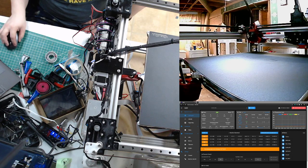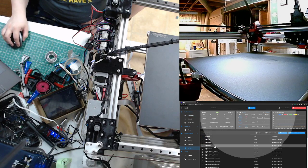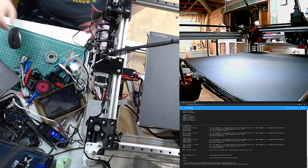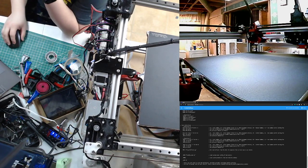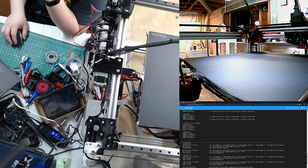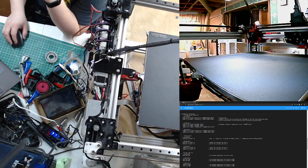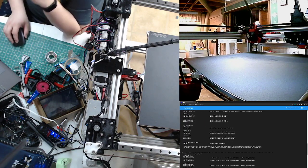Yeah, long term, it would be cool to put rubber feet on the bottom. One thing I was waiting on was how I want to do rubber feet, but I haven't figured it out yet. Here's a good way to do rubber feet. You just put an M4 tap drill hole, move the second hole so it's not at the corner, and then put an M4 tap hole at the corner point where the frames come together, and you can put a rubber foot that screws right into that tap hole.